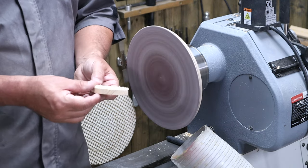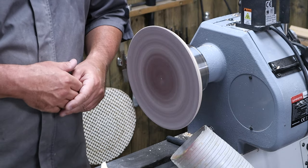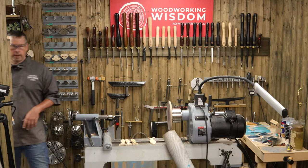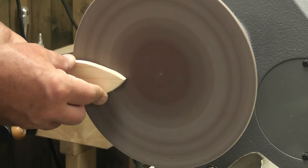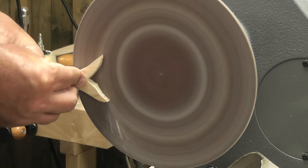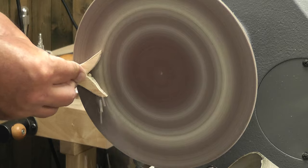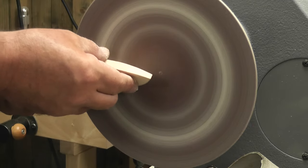All I want to do is round the edges, remember, at this stage. And it doesn't matter how many facets, how gnarly it is, because we'll use a finer sander, softer abrasive pad in a second just to blend those shapes in. So dust extraction is going on. I'm actually just tapering that front face down. And we'll do the same with the tail. Just to give it a little bit of shape, really. And then once we've done that, we can start shaping. So rounding those corners over.